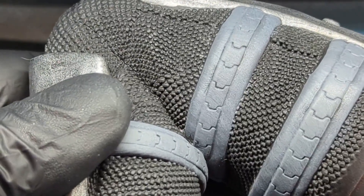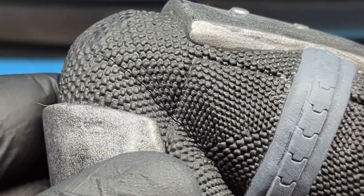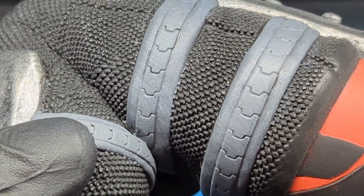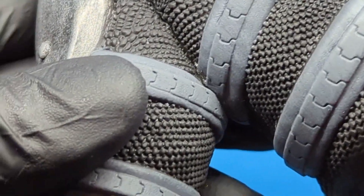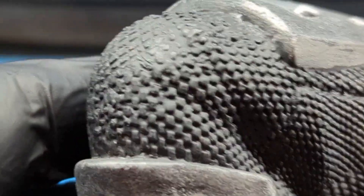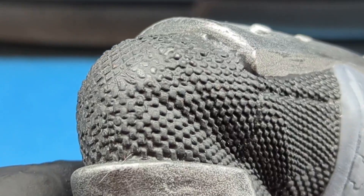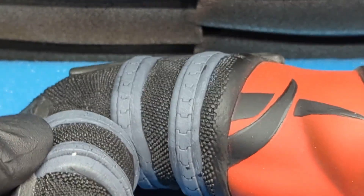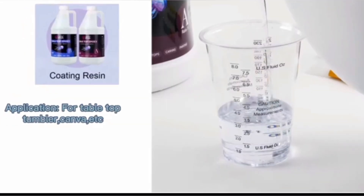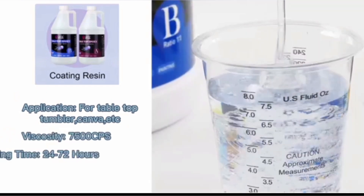I don't want to fully break the leg — that's just going to make the repair more difficult. But I do want to seal this up so that it doesn't break any further. I can barely pull it apart enough to feel comfortable trying to add some glue in there. I don't think I can pull it open enough to add glue and then close it back together, so that's not an option. Being that we can't fix it from the outside, we can fix it from the inside — and that's when today's tutorial comes into play. We're going to inject resin onto the inside and make the leg fully solid.